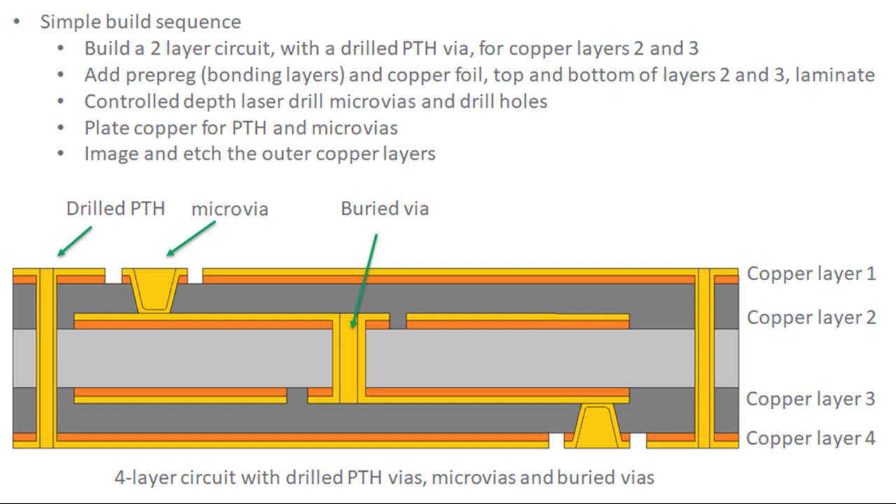Top and bottom of that, the dark gray bonding material — pre-preg — is added, then copper foil is placed top and bottom, and everything is laminated together. Next, drill the through holes on the left and right all the way through the circuit. A laser then burns a hole from the top layer down to the layer below, reflecting off it on both the top and bottom sides — that creates the micro vias. After that, apply photoresist top and bottom again, expose the circuit image, and etch what you don't want. You now have a four-layer circuit with multiple different kinds of vias.